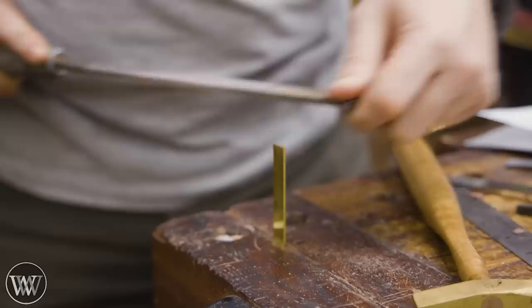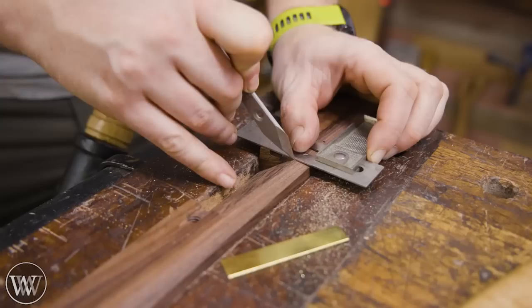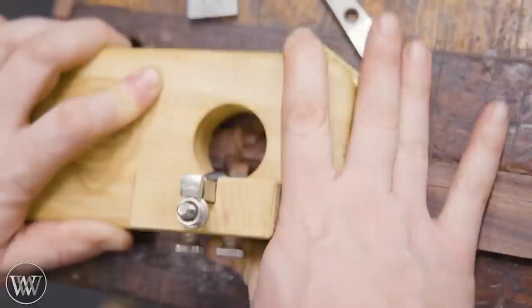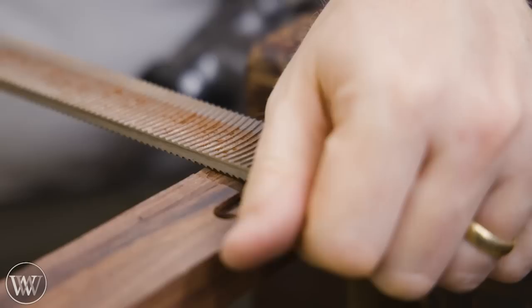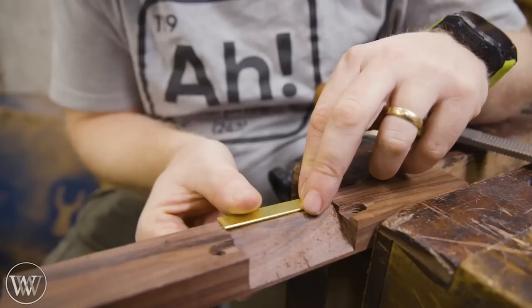The mouth on this actually has a small bit of brass — it's a wear plate, so you don't wear out the front too quickly. One of the problems with a lot of the old wooden ones is that the mouth is worn out, so we need to recess this down a little bit into the body. I brought in my long router plane to reference more of the surface, since it has a longer arm away from the blade itself, and I can get all the way out on the end. We want to smooth that out and make sure it's nice and flush with the wood on either side.